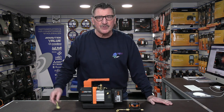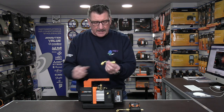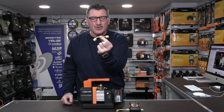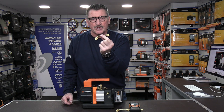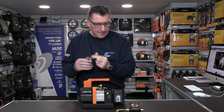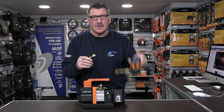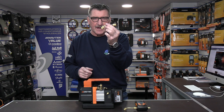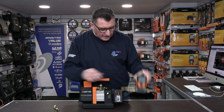What you need to do this quickly and effectively is one of these little micron gauge adapters that you normally use on your core tool to attach your digital vacuum gauge if you're using a core removal tool. These are brilliant for actually testing your vacuum pump.